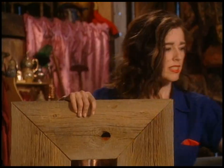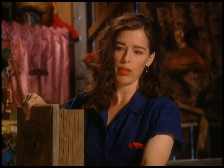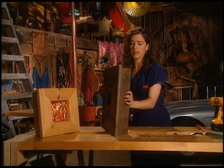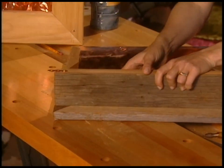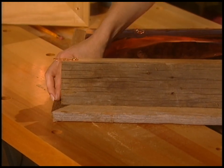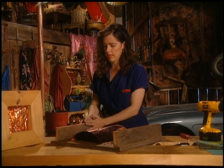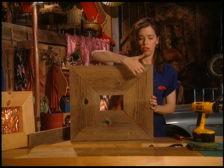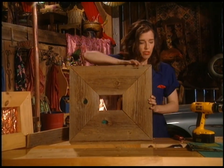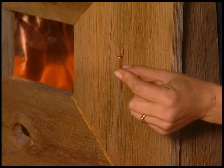The excitement mounts — it's really coming along. We have to add some side pieces, what I call back supports, so the thing is held out from the wall a bit; otherwise the copper gets crushed. They'll hold it out from the wall like this. Cut these pieces about an inch shorter than the dimension of the whole frame — they just look prettier that way — and inset them the same amount on each side. The way to attach them is to pre-drill through here and here, then I'm going to use these gorgeous big copper boat nails. They'll split this old wood if I don't pre-drill.